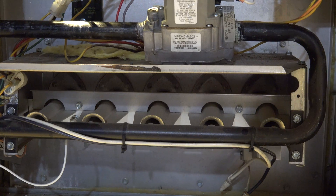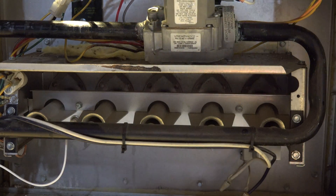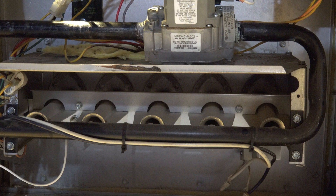Here's what happened. As soon as the fan came on, because there's a break in the heat exchanger, it changed the pressure inside the heat exchanger and the pressure switch shut the furnace off. If you notice the blinks on that control, it was blinking pressure switch control problem just before it went back to try to fire up again.